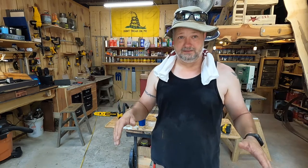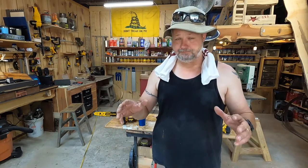To give you a little more information on this thing, the folks have a wedding venue that they're putting in right down the road from where I live. And this arbor, from what I've been told, is gonna be inside a pole barn. So it's going to be out of the weather, but we are going to have to take some special precautions with the wood that's going into the ground to make sure it doesn't rot or termites don't get in it. There's a couple different methods they can use when they're putting that in the ground, and I'm not going to speak to which one they're going to use, but I have told them that they'll need to treat it somehow to get it to last. If they can get 5 or 6 years out of this thing, I think they'll be happy. But hopefully with the right treatment, it'll last longer than that.